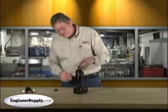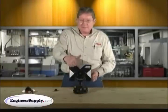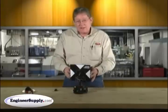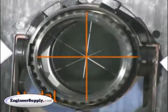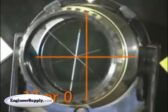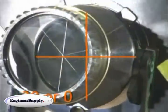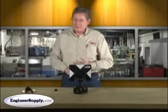This offset can be tested by pointing at the center of the prism — the apex — with your total station, and then having your rod man turn it back and forth in azimuth, or up and down in tilt. You will see that the apex of the prism stays directly on your instrument crosshair and doesn't move. Whereas if you change it to negative 30 or a zero offset prism and do the same test, you'll see that when you turn it in a rotating adapter that holds it over the plumb line, it moves off-center. A nodal will not move off-center — that's the advantage of a nodal.